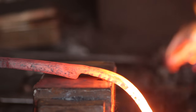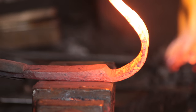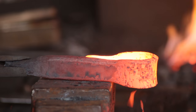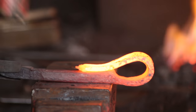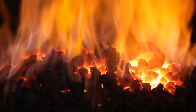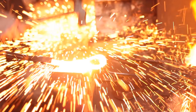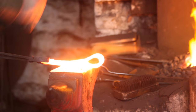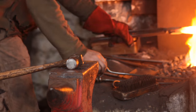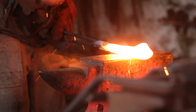With that done I will roll over the eye. Having done this — like most of my videos — this is an experiment. I think it would have helped to go in with a fuller to round off that eye a bit more and create more of a lip on the side that's going to be welded. Now it's time to weld: I stick it in the fire with the eye sticking out and the main bar in the fire, spin it around. This is wrought iron so I'm running a neutral fire, a nice big molehill fire. You don't need any flux — wrought iron is self-fluxing. I'll take two or three heats to make sure it's nicely welded.